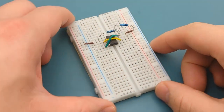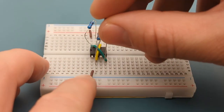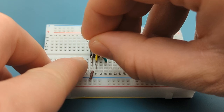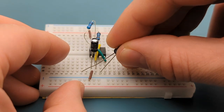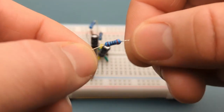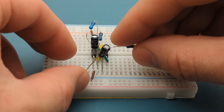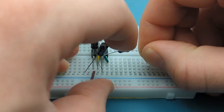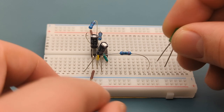Turn the breadboard to the side. Insert a 4.7 microfarad capacitor into pin two (trigger) and pin one (ground), with the shorter leg into pin one. Insert a 10 microfarad capacitor with one leg into pin three (output) and the other leg two rows above the IC, with the shorter leg into pin three. Bend the ends of a 200 ohms resistor and insert one end into pin three (output) and the other end several rows below the IC. Insert one leg of a green LED into the same row as the resistor and the other into the negative rail, with the shorter leg into the negative rail.